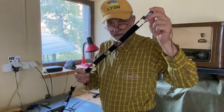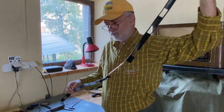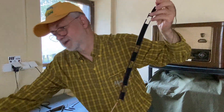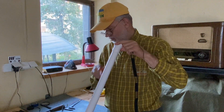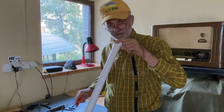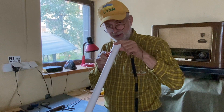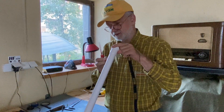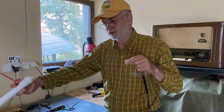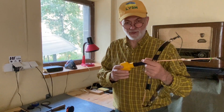If your antenna will hang in the open air as a roll-up, that's it. But if you decide to put the antenna into a plastic pipe as I did, make all your SWR measurements with the pieces of antenna already inside the pipe at each step. That will prevent you from cutting the wrong length of cable.